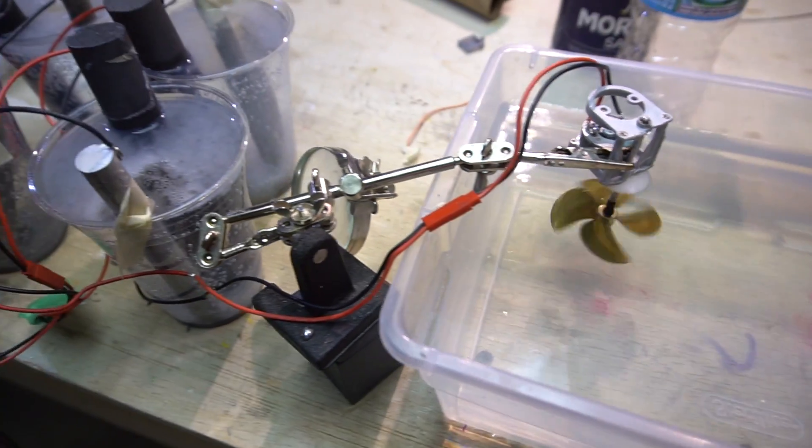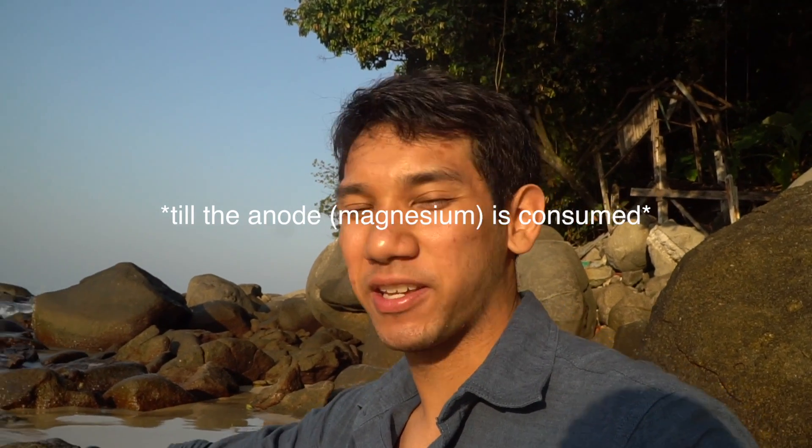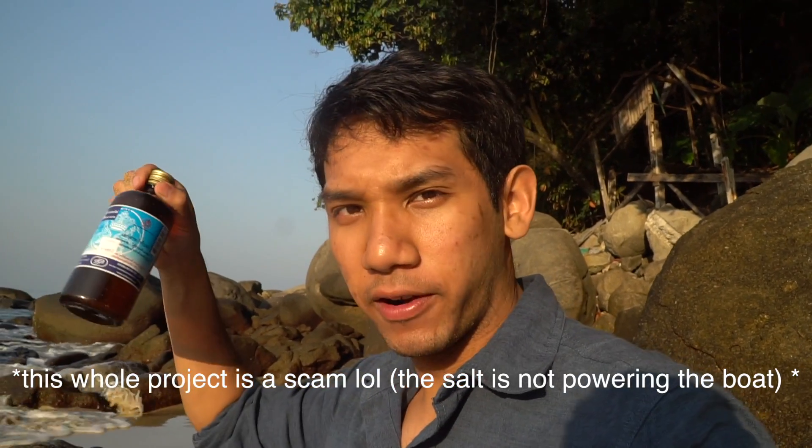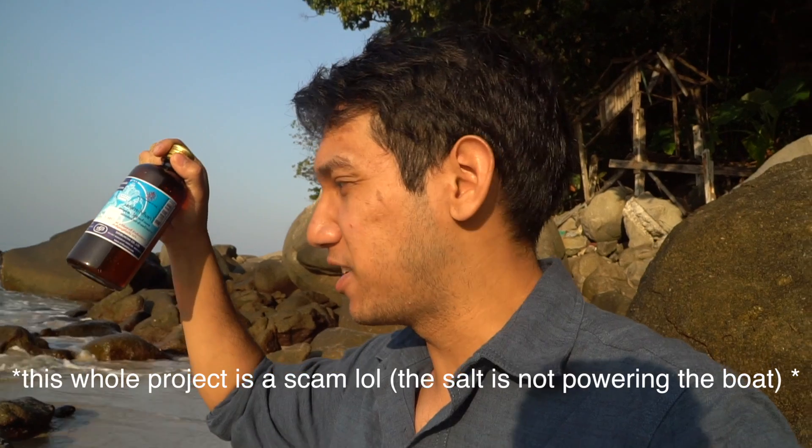You generally lose all your voltage and amps and stall in the water after about 10 minutes or so. But I found out through research that if you add some hydrogen peroxide, it helps the oxidation process continue throughout the anode and keeps the magnesium hydroxide buildup from forming on the anode surface, so it continues to get current. When I tried this at home I actually got about 24 hours of continuous power out of it and it was still going. In this configuration with the series setup and hydrogen peroxide, it should continuously run.